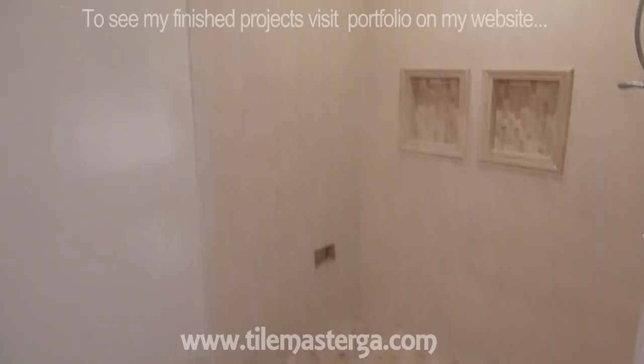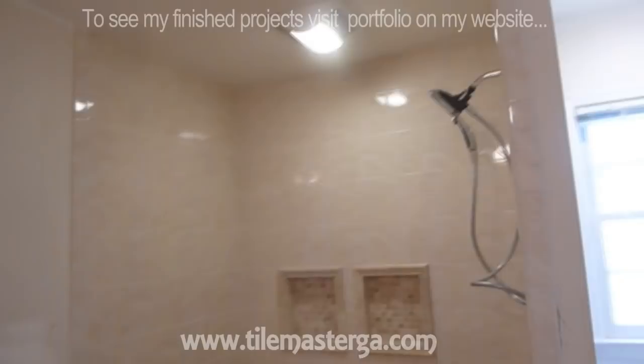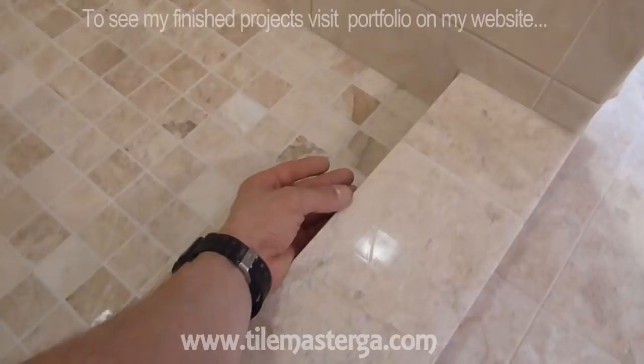In this case, with this setup, we can temporarily install the rod with the shower curtain. The shower goes wall to wall, so if we hang the curtain for a week, that should be fine. But a shower curtain is never recommended for a walk-in shower, simply because what often happens is the curtain will slip through the curb, because there's not a lot that actually holds the curtain in place. It's just about 2.5 inches.